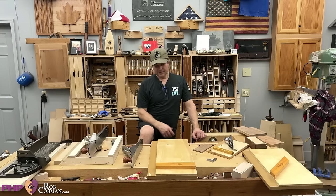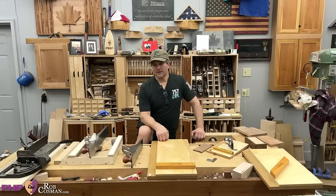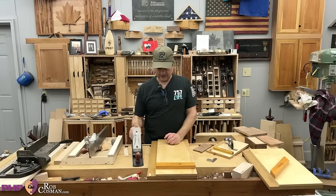Next, Frick. Jim's got a good question, Jim Pearson. He said, often the sides of planes are not square. How do you compensate that the sole is not actually square to the face of the shooting board? Yeah, good question. Tell you what we do. We have a big 30-inch disc sander, monster of a thing. And we sell Wood River planes everywhere but in the U.S., and we go in and we square the sides.